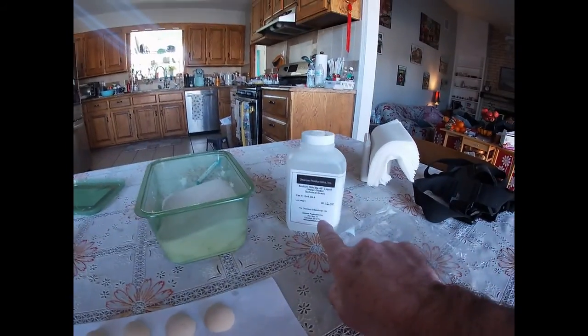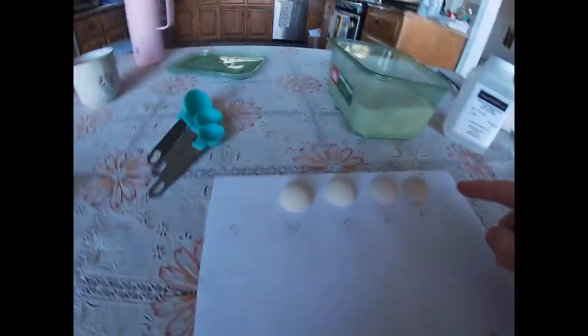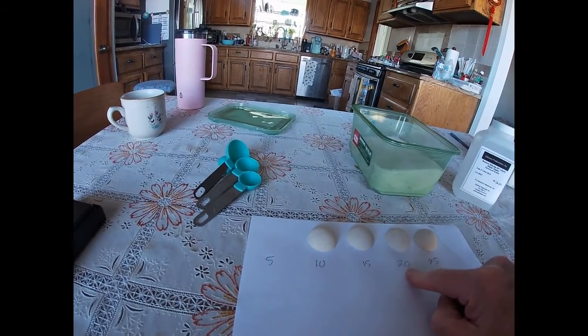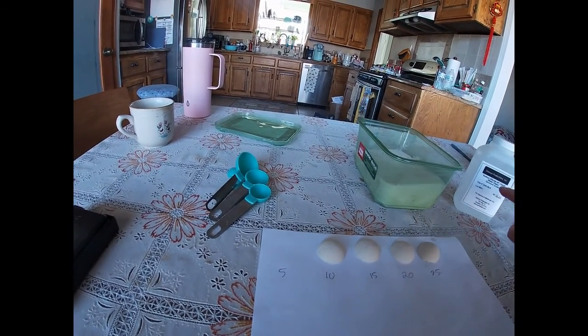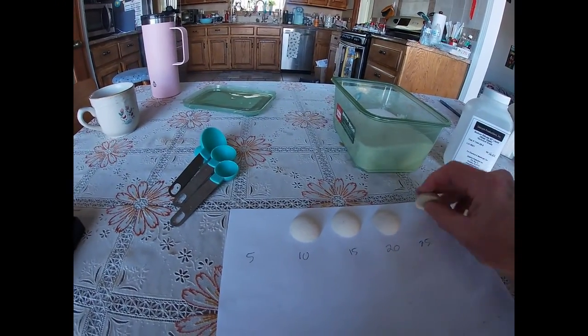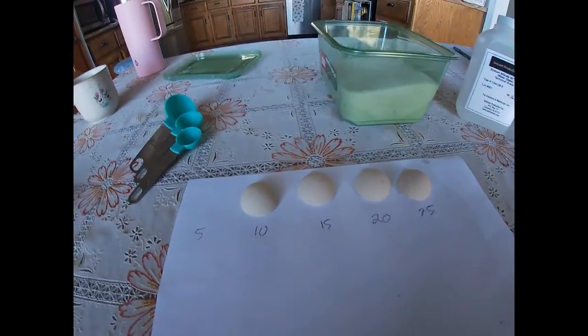The internal piece of my mold is going to be made of silica sand and sodium silicate. I've done tests at 25 to 1 gram, 20 to 1, 15 to 1, 10 to 1, and I'm going to make a 5 to 1 gram mix. Then we'll go over the hardness of each one - I'll break them so we can see which is the best to use. Everyone has their own recipe and I just wanted to see which was best.